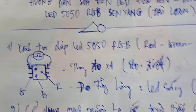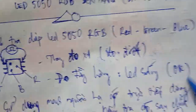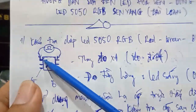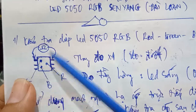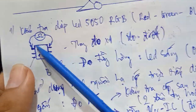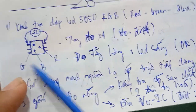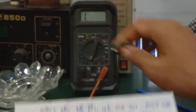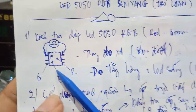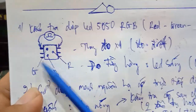The LED lights up, and inside there are 3 colors: red, green, blue — that means it is OK. In some cases, the LED inside may lose a color. You can then identify it as defective. For example, if the LED loses the green or red color, it only has 2 colors left, which affects the color output of the lamp. So you must check all 3 colors — red, green, blue. If one is missing, you can replace it.